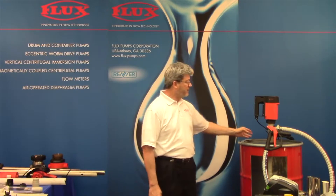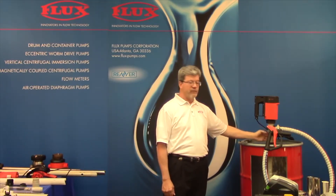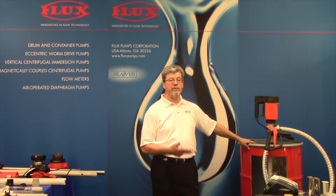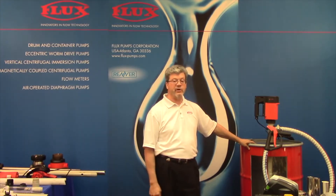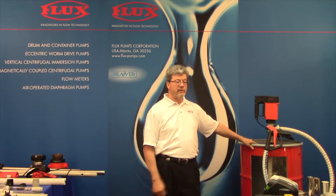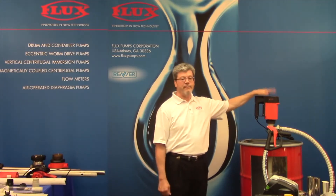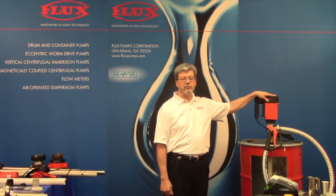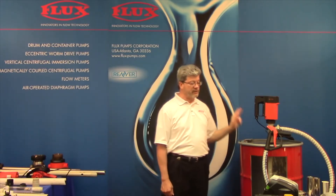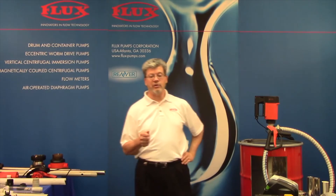If you select the right material pump — poly, kynar, or stainless steel — every other wetting component is going to be covered, and you'll be protected, the customer will be protected. We make these for drum, drum length, 275 gallon tote, and 330 gallon tote. We make them with electric motors as well as explosion proof options in electric or air. Please keep these in mind — you can find the kit information also on the app.